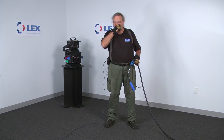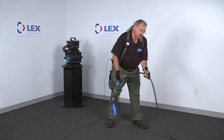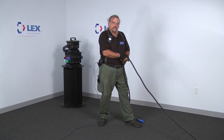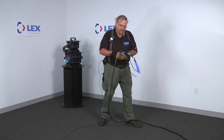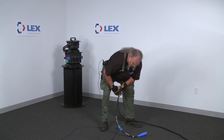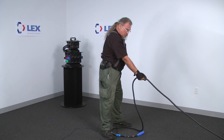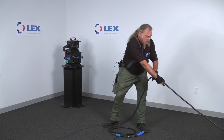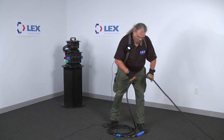To start, make sure the cable is de-energized and your ties are free and clear. Pull with your entire body rather than just your arms, so you can really get your back and your legs into the motion of pulling. Get the coil started, then rather than being square to the cable, turn your body slightly sideways so you can use your entire frame to pull it.